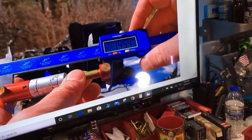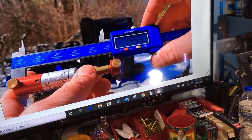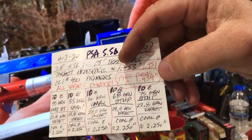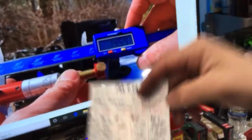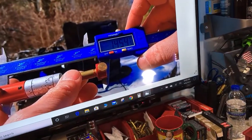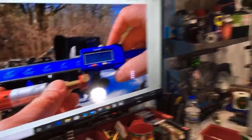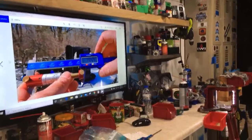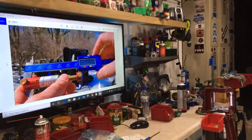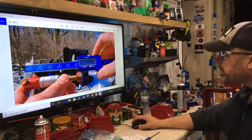And now we just bumped that 3/1000ths of an inch, based off my bump gauges, not your bump gauges. Your bump gauges will read that differently, so keep that locked in your brain. Can't stress that enough. So if you guys got any other questions, you better let them rip here soon.